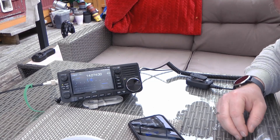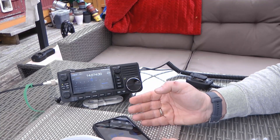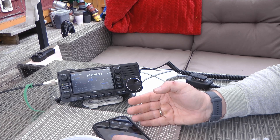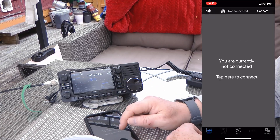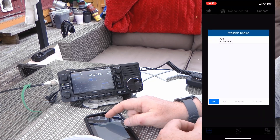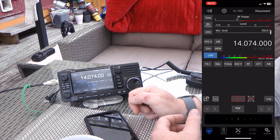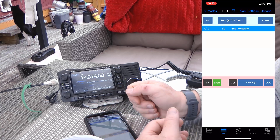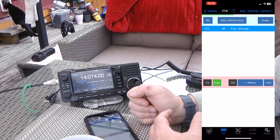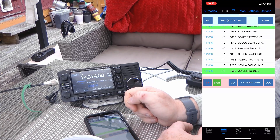We have both the radio and the phone on the same network. We start the SDR Mobile app, get a welcome message, press 'tap here to connect' — everything's set up with the radio on the same network — press Connect, and we're connected to the radio. Next we press the Modes button, press FT8, press the RX button to activate FT8, and we'll let this run for a cycle to see that we receive some signals. We got some signals, so let's call CQ — press the CQ button and see if we get a reply.